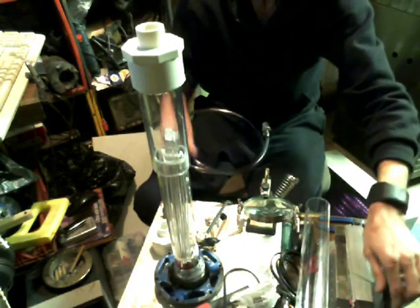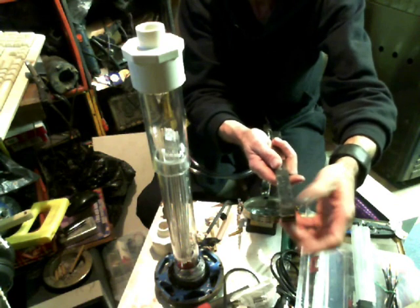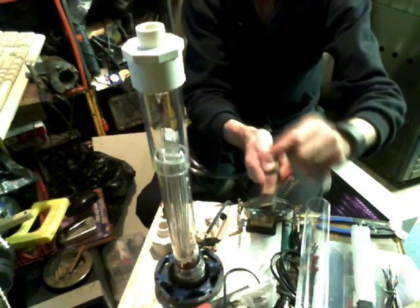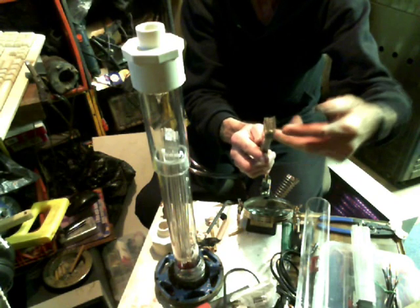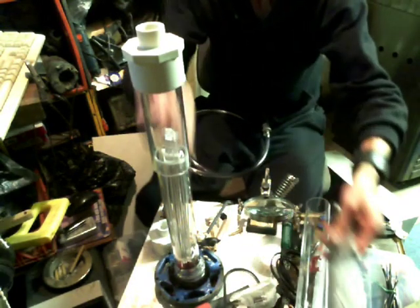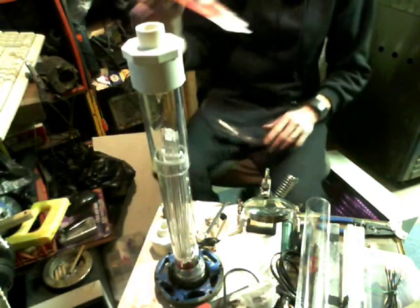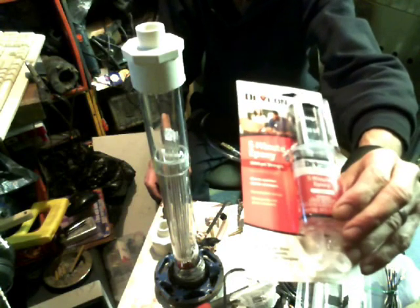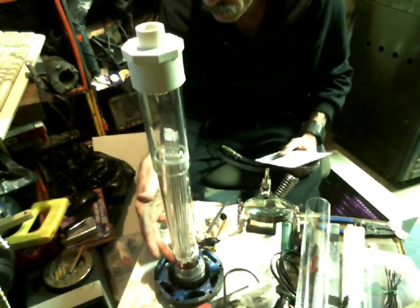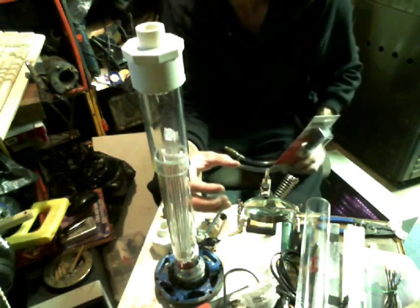I used some bits of wire like this in order to connect all the plates. I was initially going to drill holes through these — a little hole and then a big hole — and on the opposite plates the holes would be different, so I could run a bolt through the side and it wouldn't touch the wrong plate. But working on a bit of a budget, I used two-part epoxy resin down in the bottom to seal it. I got a paint cap, made a mold down there, poured the two-part epoxy resin in, mixed it up, and set that down on top.